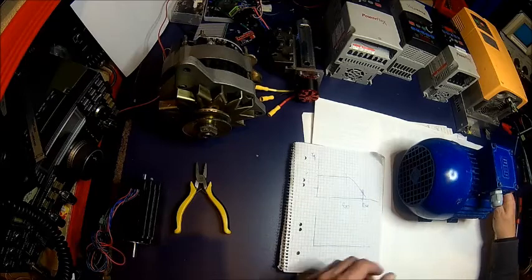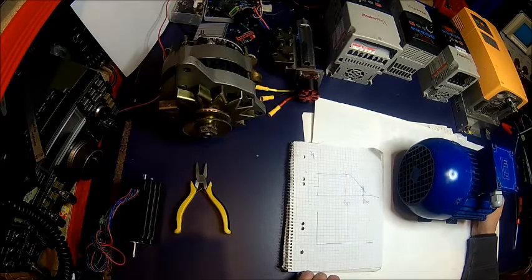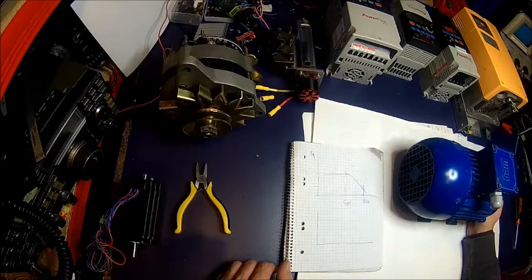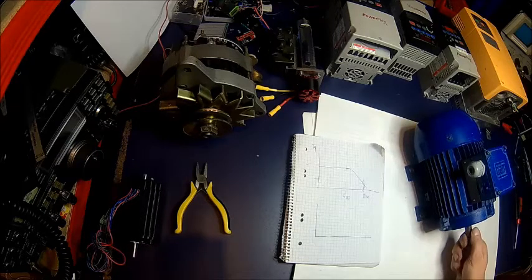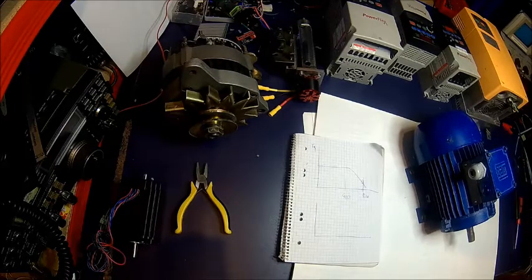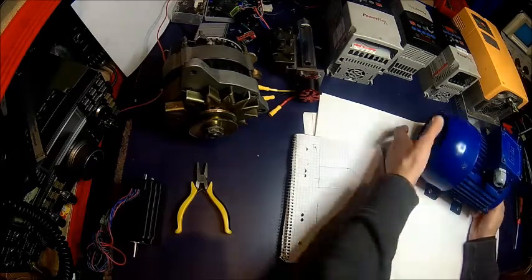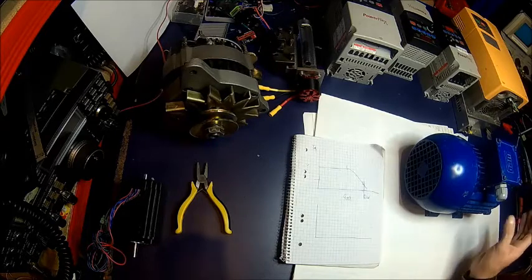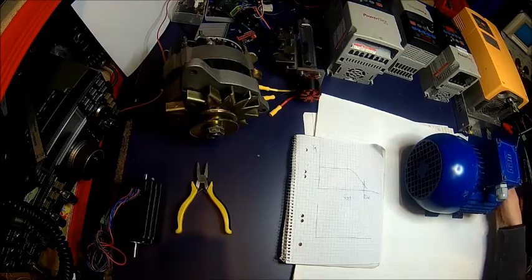The second issue at the other end is the maximum speed of the rotor design — the rotor will fly apart at some point due to balancing limits. There's also the bearing rating; bearings not suitable for high speed will cause issues. However, if you don't do that continuously, this motor can easily run at 3000 RPM even if it's rated for 900. If I use a very wide speed range I would actually remove the fan and fit an external one, because the fan is designed for 900 RPM and moves far too much air at 3000 RPM.